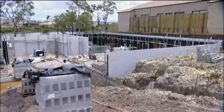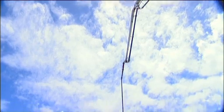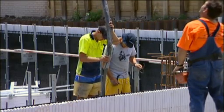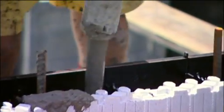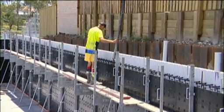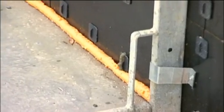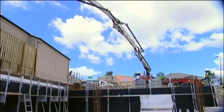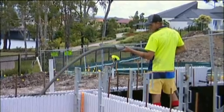With the wall set up, you are ready to pour the concrete. Concrete is usually 32 MPa, 10mm aggregate, 160mm slump, standard block fill mix. You can add waterproofing agents as specified. With the appropriate size boom pump, you are now ready to pump the concrete from your preferred concrete supplier. The reducer at the end of the boom pump reduces down to a 50mm rubber hose for easy control of the concrete flow, and also reduces the velocity of the concrete. Continue in a clockwise or anti-clockwise direction in lifts of 900mm per pass per hour. We recommend installing 100x50 timber handrails even if the height is less than 2 meters. Ensure your concrete is always fresh by having the next concrete truck arrive after the last one has finished, and check the slump before discharging into the concrete pump.